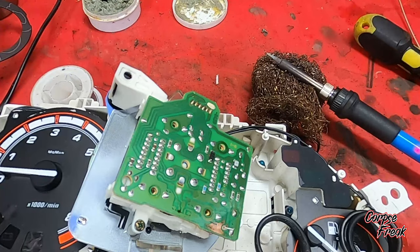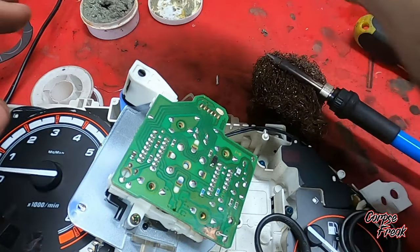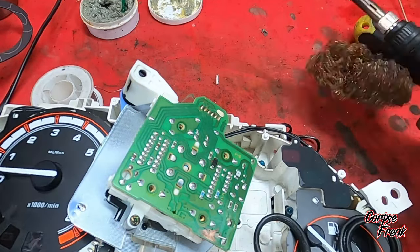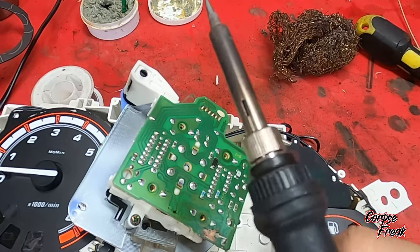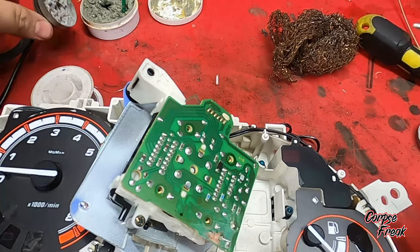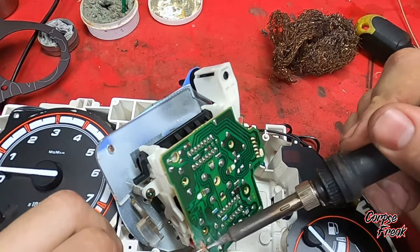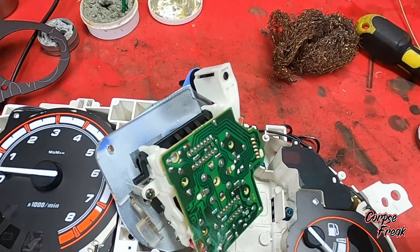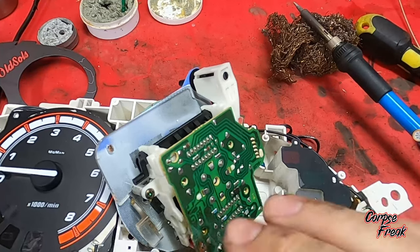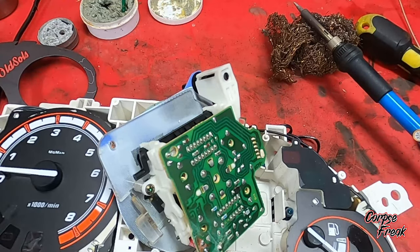Bend the little legs so it doesn't fall out. I'm going to use this tinned paste flux — you can buy this at Home Depot and I will also link an Amazon link in the description for the capacitor as well. I'm using some 60/40 leaded solder, which is my preferred solder. I'm going to use a little bit of tip tinner first, then we're just going to solder the joints. After that, use some flush cutters to make sure we get it cut nice and tight.